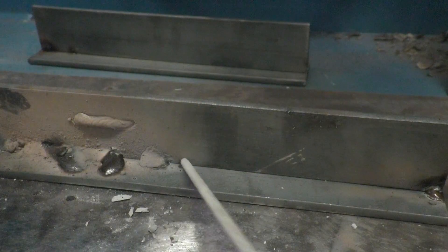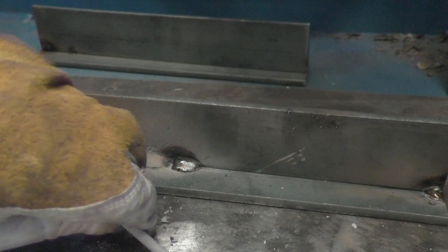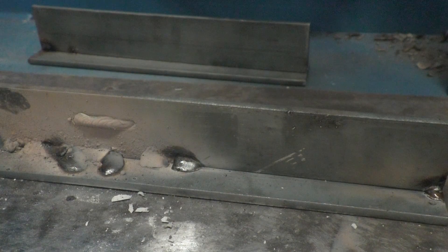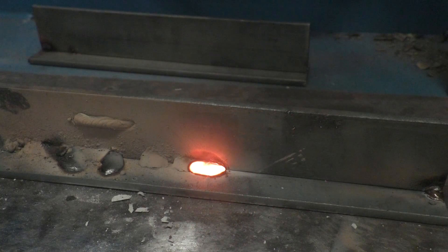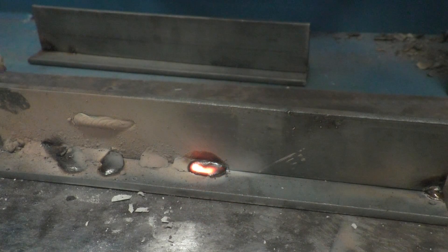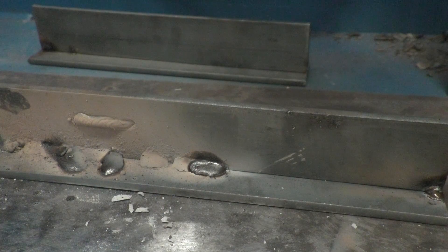Let's see if this strikes right up — well, it would have if I didn't stick it. Push it in, pull out quick. I have that little cup end exposed. I'm going to just roll that off with my fingertips. I hit my hand on something when I went to strike the arc — maybe it was the bench. We'll try it again; it's a little strike and it should show up. Don't think that you can't reuse those electrodes. You should be reusing them even if they're only four inches long — just pick up where you left off and keep going.